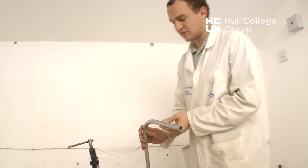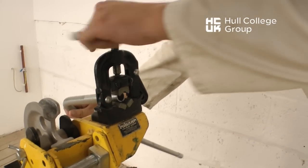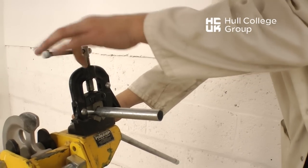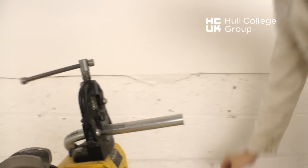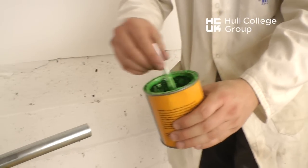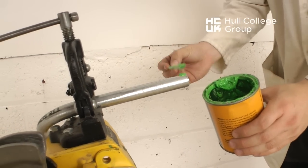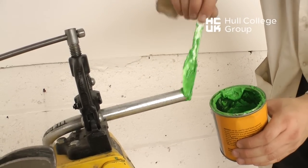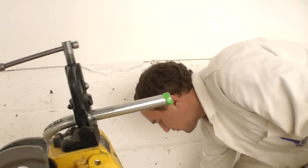One end of this particular piece of conduit is already threaded, the other end is not. This end needs to be threaded now by using the pipe vise on the bending machine. Secure the actual conduit in the pipe vise as shown. Smear compound on the part to be threaded. This eases the cutting process.